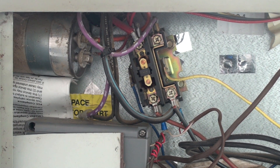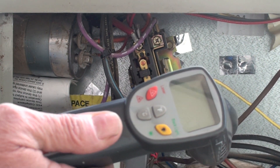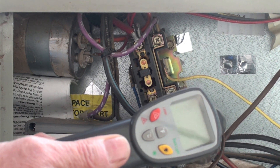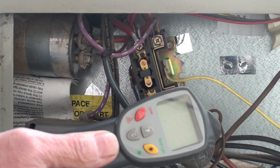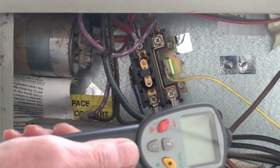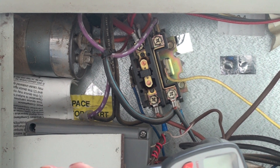This is a short one on using the infrared point-click temperature probe to see if your connections, contactors, and those sorts of things are actually making good contact. This is a cheap one here — it works but it's not real accurate — but the one thing it will do is check the temperature of potentially overheating terminals.